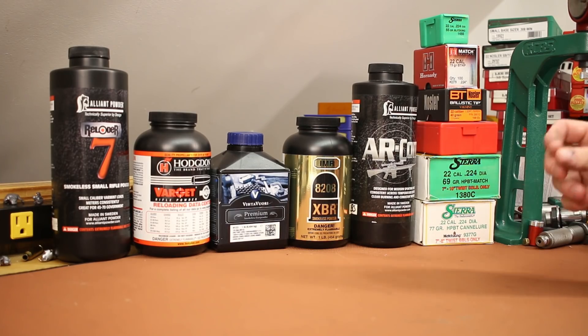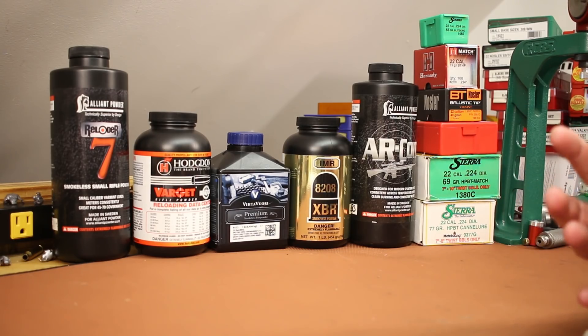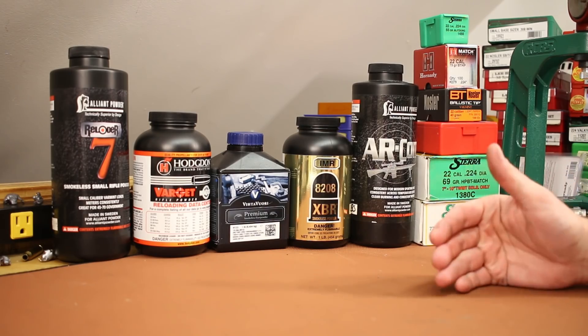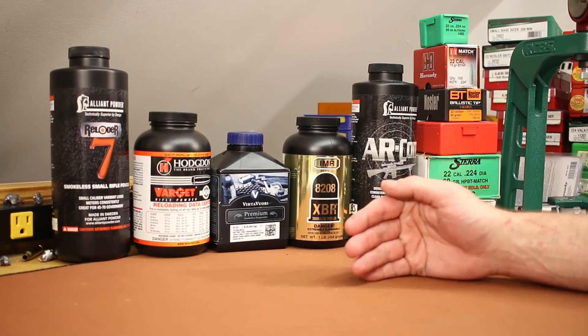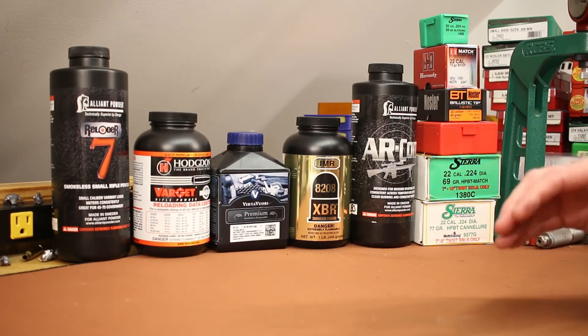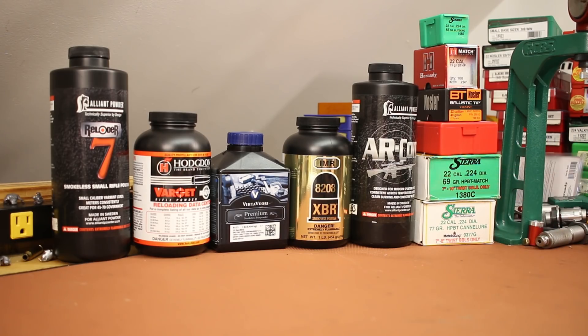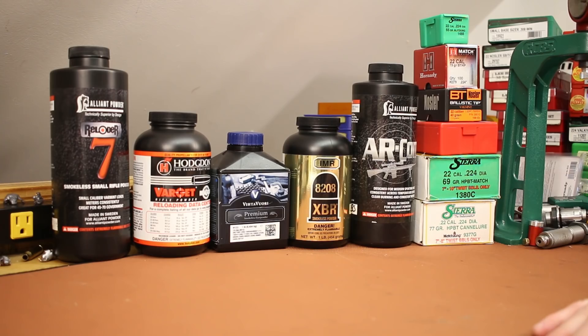One thing I was worried about: this Predator barrel has a different chamber with a little bit shorter throat. I was afraid that some of my older loads wouldn't fit into this new chamber — we would be jamming into the lands. But I was happy to find out that none of them were into the lands of the new barrel. I took some measurements on that throat; one barrel is nicely worn in and throat erosion is a thing — your distance to the lands is going to creep as the barrel wears in. For my old SPR and the new Predator, I saw as much as a 90-thousandth difference depending on the bullet and ogive shape. Some were only about a 40-thousandth difference. The good news is all of the old loads at the overall lengths we shot previously fit just fine in this new barrel. Also, all the brass I've prepped for my SPR barrel fits into the chamber of the Predator barrel as well — no problems. Pretty good compatibility so far.